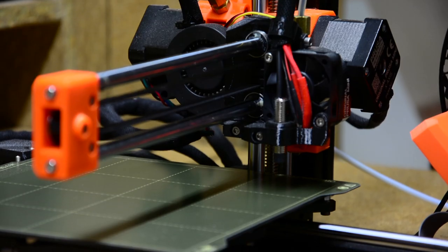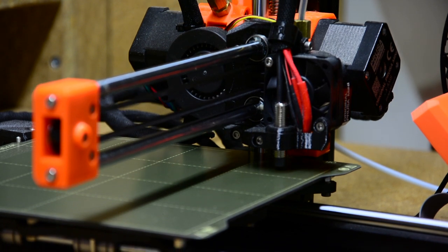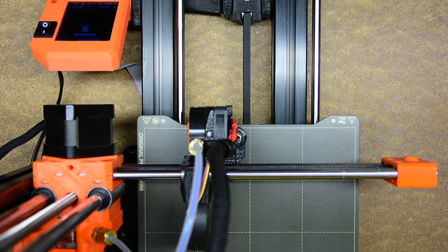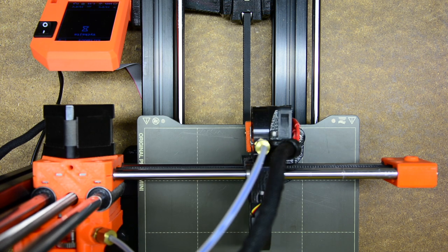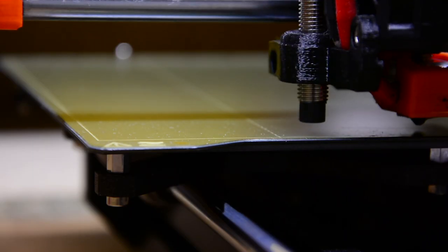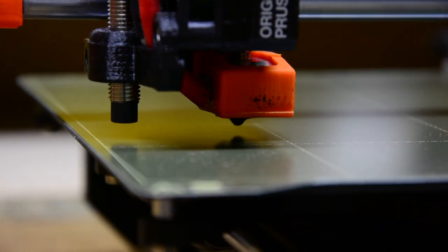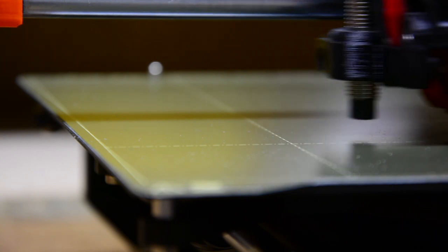Then I scaled it down to two SSD drives because of the power consumption and other services I wanted to run on it. The opportunity to make a new re-edition appeared when I picked up 3D printing and thus 3D modeling. Now I could have an enclosure that exactly fits my needs. The hardware goal was to keep some form of passive cooled motherboard and switch from SSD drives back to hard drives due to the demand for a larger disk space.